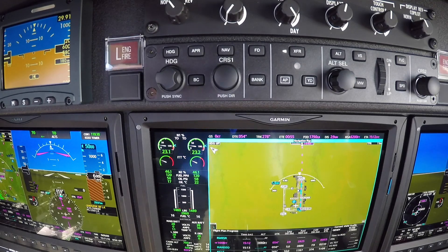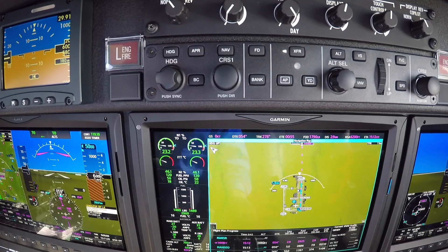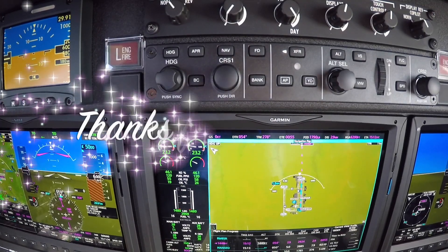Now that it's stable, I will tell him to disconnect the GPU, and we'll look at the voltage. The 28 volts will drop down to 24, and as soon as I know he's disconnected, I can turn on my generators and do a generator check. You're just basically turning them on, turning them off one at a time, making sure the other one picks up the load, et cetera. So that's it — thanks for watching.